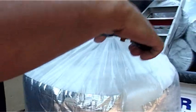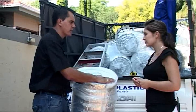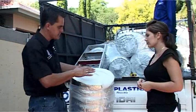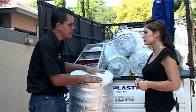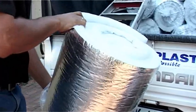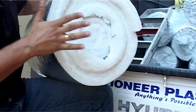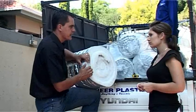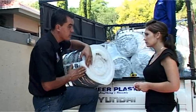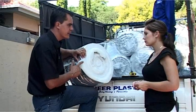Let's open up one package and verify the thickness. This is a soft polyester fibre, so there's no irritant, no itch to the product — it's basically the same as what you've got in your bedding material and your cushioning. During the process of producing the product, when we pre-slit, the edges of the material are cut with a crush cutting blade. At 8 bars it crushes the material and the edges fuse together.